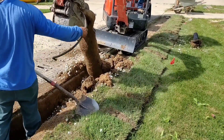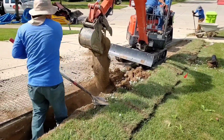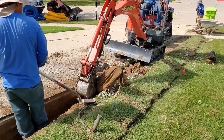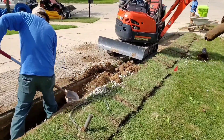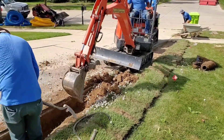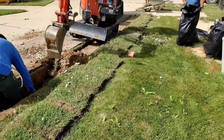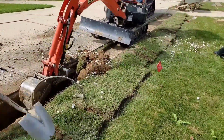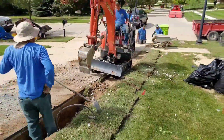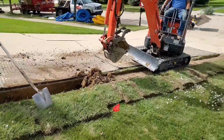If it's a really big crushed stone you're fine, but this is the NDS styrofoam french drain - look at that. Unfortunately this homeowner had to pay twice to get his drainage problem solved. We're going to replace this styrofoam french drain with a corrugated pipe and inch-and-a-half round rock. We're going to line the trench with a non-woven geotextile filter fabric and install some blind inlets. We're going through the whole install, but right now we're just trying to remove this old french drain system and some additional dirt, because a styrofoam french drain is not very big in diameter.